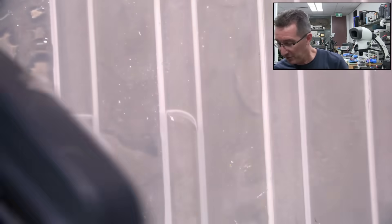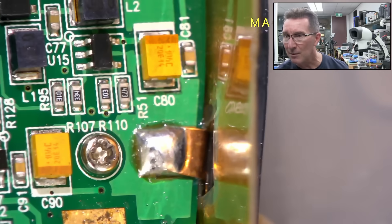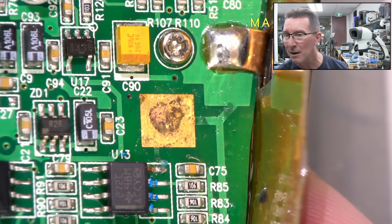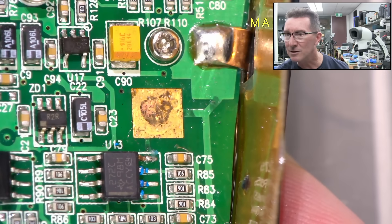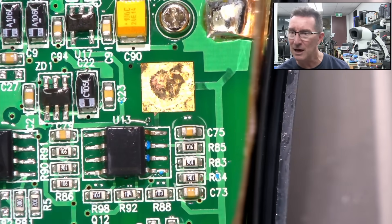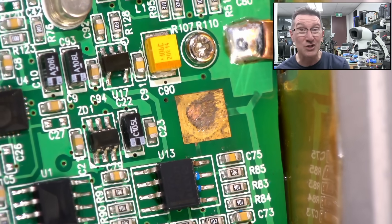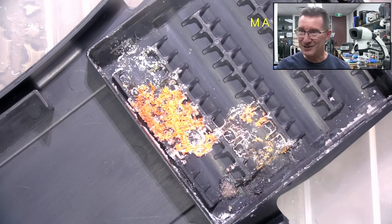Isopropyl. They've got lots of shielding on this sucker going right up both sides here. I think we're gonna be in luck saving this. Be surprised if that's damaged in any way. As I said, it looked like maybe a bit of corrosion on that contact, and it looks like maybe something has gotten under the traces there, under the solder mask on the copper. And maybe that pin there on U13 — one of the pins looks a bit tarnished. Generally not too bad — pretty happy with that. That battery contact there has really got some solid corrosion on it.